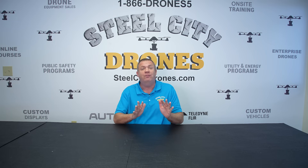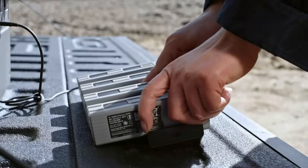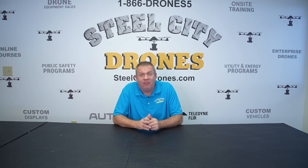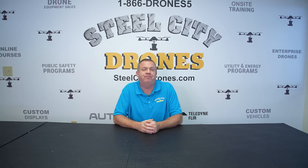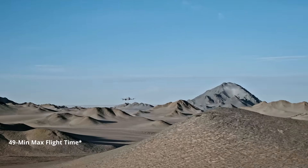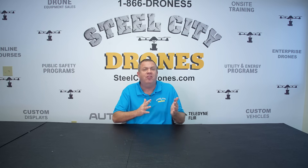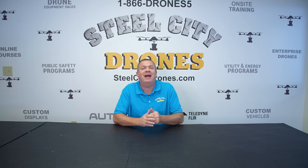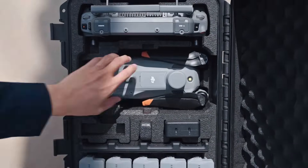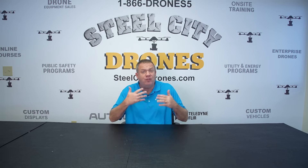Now there are a few surprise moves that DJI has done with this new release, and the first one is that the Matrice 4 Enterprise has just one battery. It marks the first time ever that a Matrice Enterprise drone has one aircraft battery, which is quite the departure. Even though the aircraft takes just one battery, it has very similar flight time compared to the Mavic 3 Enterprise, so it's not going to lose flight time. It is a lighter aircraft as well — smaller than the Matrice 30T and right around the same size as a Mavic 3. This is also the first model that allows us to swap out the battery very quickly, as quick as 15 seconds, compared to traditional two-battery hot swaps.